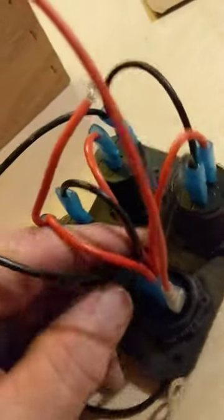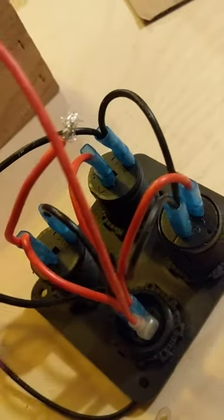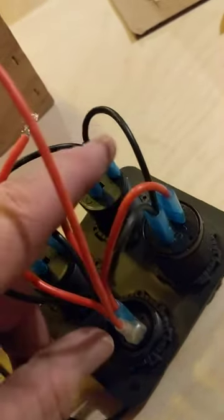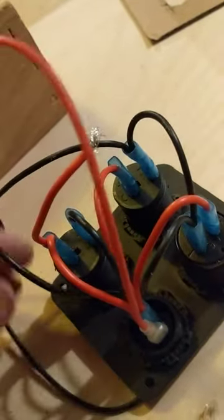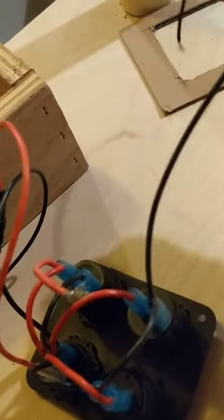On the ground, we're also doubling it up because I have three wires going in there and couldn't fit a fourth one, so we just jumped — went to that one where it split off to a third. And then because I have LED lighting, I have it going off to the LED lighting so it's branching off again, but you don't need the blank wire going out.